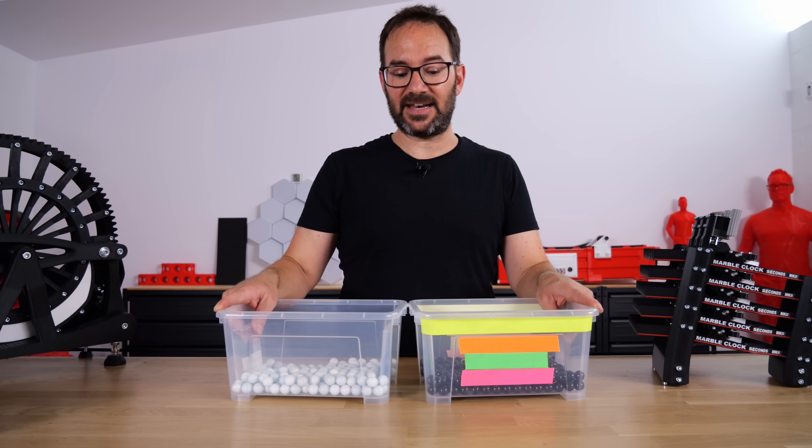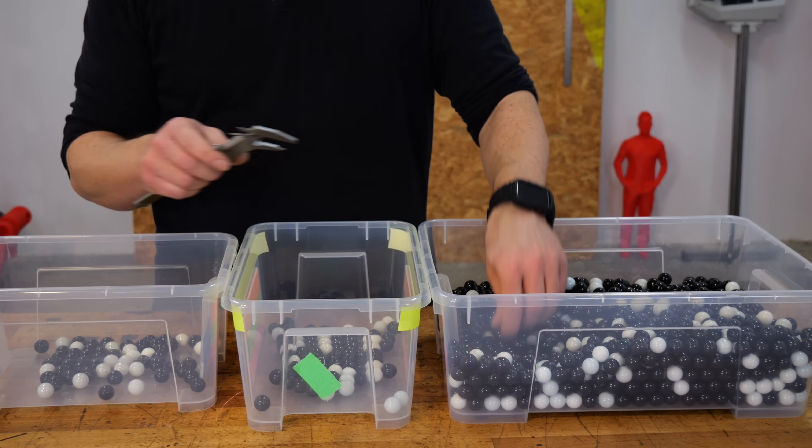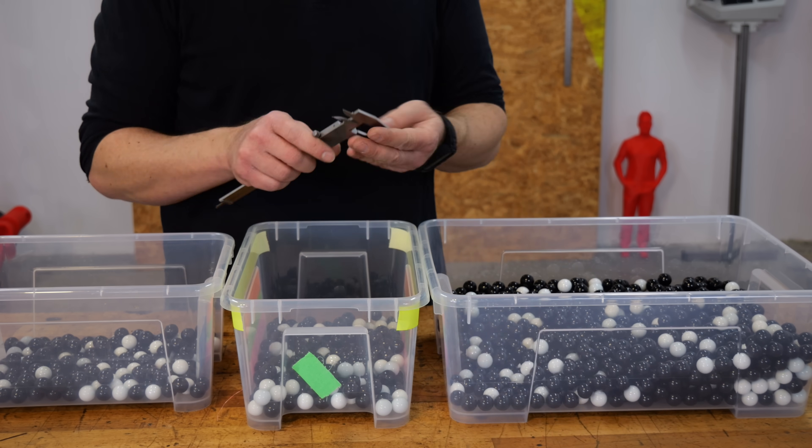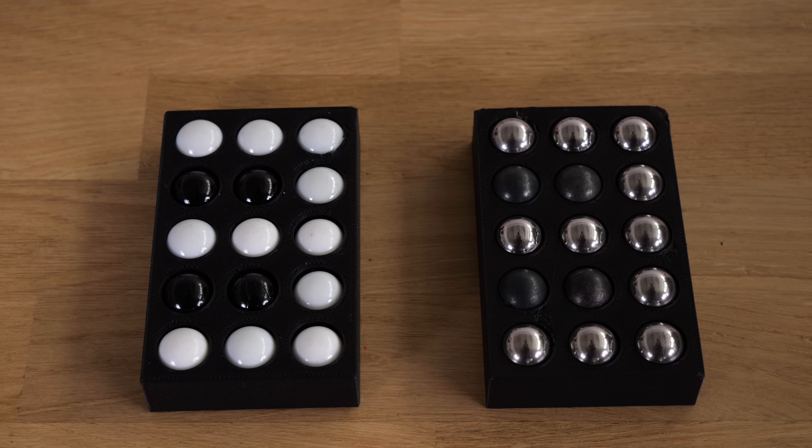So the first thing I'm going to do is something way less painful than the alternative: I'm going back to glass marbles. I know I found lots of issues with the glass marbles in the previous clock, and that's why lots of you commented that I should use steel marbles. But that brought the painful task of making half of them black, which was way worse than just sifting through all the marbles and selecting the ones that are round and within the desired diameter. But the biggest reason to go back to glass is contrast — you can easily see which one is which. With the silver and black marbles I was having a hard time seeing the numbers. Please feel free to leave a comment — would you rather me use glass, steel, aerogel, expired cakes? Either way, that solves the issue of the black marbles having more friction than the white ones, because both glass marbles have the same friction.